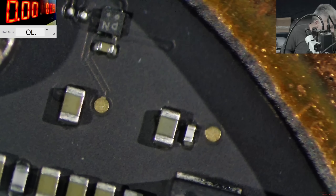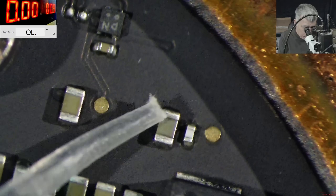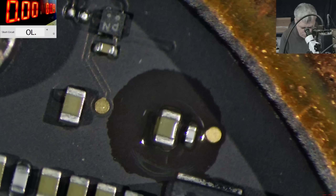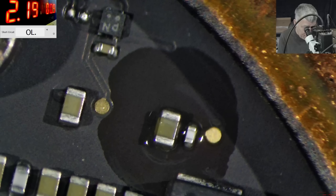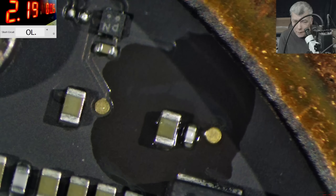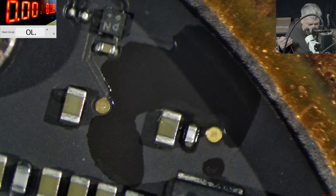So what I'm gonna do — I'm gonna use some alcohol, just a little bit. And that will show the current going to the same point. So pay attention — check there, that capacitor. Power on, off, on, off, on, off. Yeah, so that capacitor is gone.